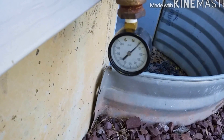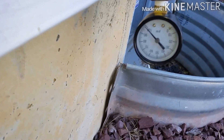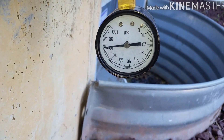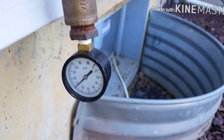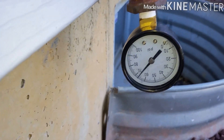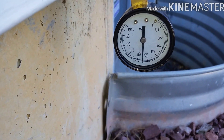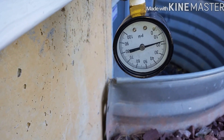I'm gonna check the pressure using my gauge for the house — see it's at a hundred. Go ahead and just put the kitchen faucet on please. Kitchen faucet running at 70 PSI. Go ahead and flush that first-floor toilet. They have a PRV inside — a pressure-reducing valve — it should maintain between 60 and 75. That was the kitchen faucet running and her flushing the first-floor toilet.